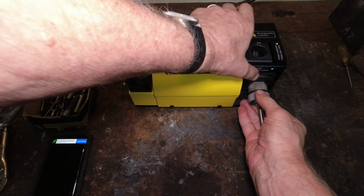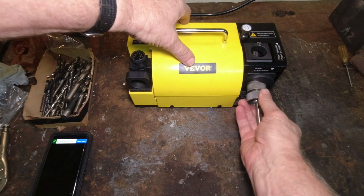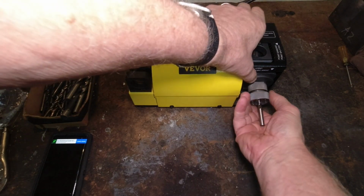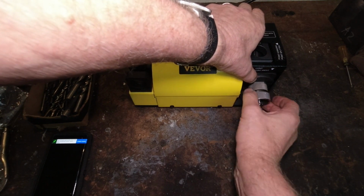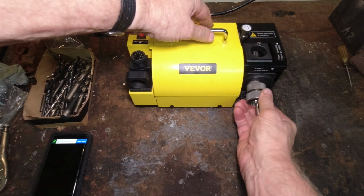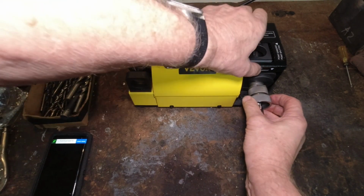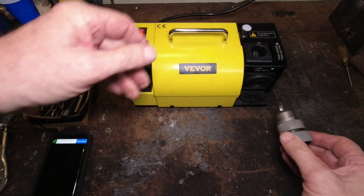and until it goes in, then we're going to rotate back and forth until it doesn't touch the grinding wheel anymore. Then we're going to rotate this 180 degrees, get it back in again, and do it again. Back and forth until it stops and until you can't hear the grinding sound anymore. And I usually do it a couple of times just to make sure. Yep, okay, we're clear.